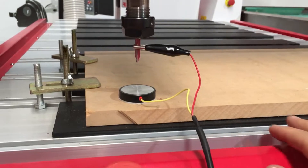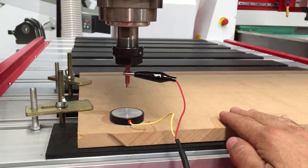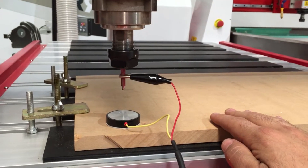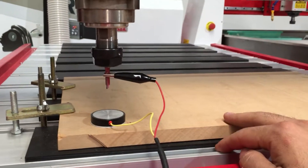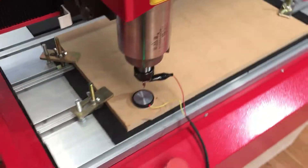This will set the workpiece height. Our zero reference is from the top of the workpiece — this is quite important, because some machines and some software set the zero workpiece from the bottom. We work from the top, that's our zero, so just make sure when you write your programs it's set from that location.